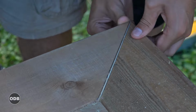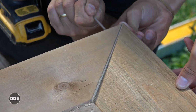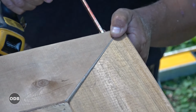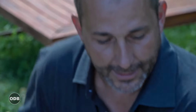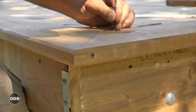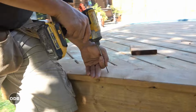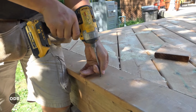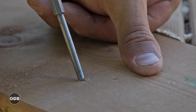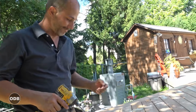What we're going to do here, Nate, is we're going to screw this joint together. Just give me a second. And we're going to use traditional screws for this. We're going to get it started. I'm going to run on reverse, what I like to call cauterizing the wound. And the reason I'm using a traditional screw on the edge here is because a camo screw driving straight in doesn't have a head, so it's not going to hold anything together. Now we can throw a screw here. So when I'm screwing down my picture frames, I'm still using this kind of screw. The camo screw is marvelous. Going right into, I'm going to just go in at a bit of an angle, right into my rim joist underneath. Then go flush, plus a quarter. Now when this wood swells up, a couple of rainstorms later, that hole will just be grown over, you'll never see it again.